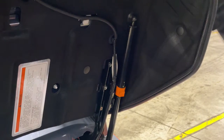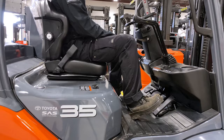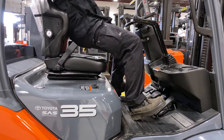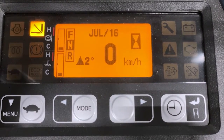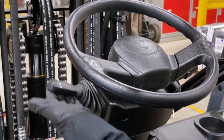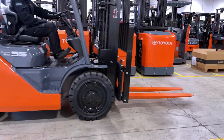To release the hood, press the orange indicator button. For the controls to work, you need to be sitting in the seat of the forklift. If the forklift is in drive and you take your weight off the seat, you will hear a warning beep and the screen will indicate a message to return to operating position. You will need to shift the forklift into neutral, then back into the drive position to allow you to continue operation.